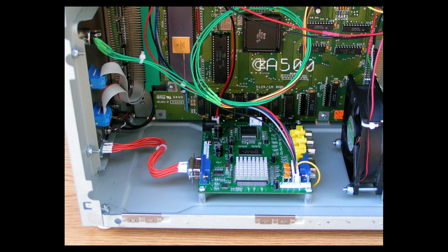I highly recommend it. Okay, the orange wired cable is my custom VGA extension cable. And as you can see, I soldered everything and heat shrunk all the soldered connections. I mounted the RGB, the VGA board, on aluminum standoffs. It's nice and secure. I mounted the 80mm muffin fan on right angle brackets, and it all works really well.